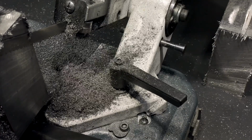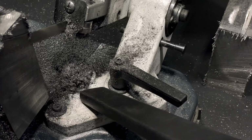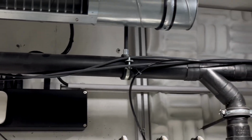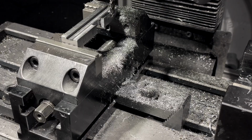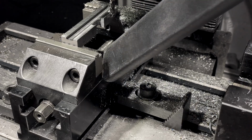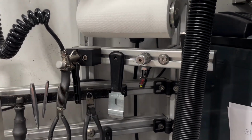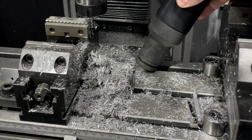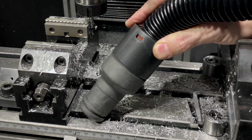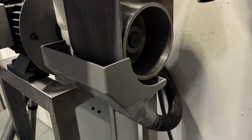It's located behind a wall to get rid of most of the noise, and the vacuum is distributed to multiple locations in the workshop through plastic pipes. A couple of vacuum hoses are connected to that piping simultaneously, so the resting positions of those hoses always need to be closed so that only the hose in use gets all the suction power. However, with the dust collection attachment of that belt grinder, it is no longer possible to seal that hose when it's not in use.